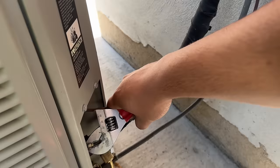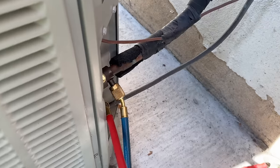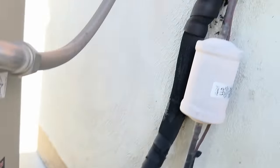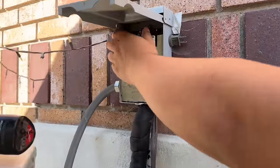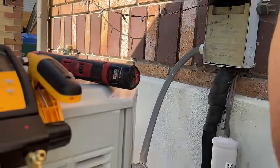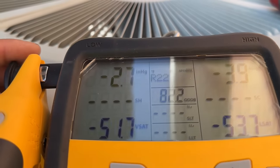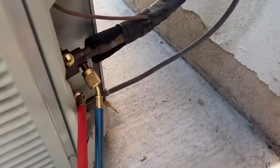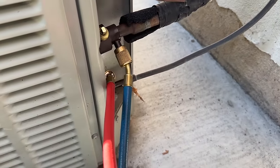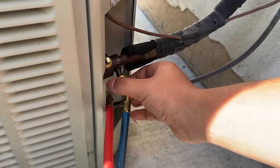Go ahead and close it — that's perfectly perpendicular. We're going to pull the disconnect out now. Hopefully, if it's properly closed, the pressure will not rise. Looks good — so we can disconnect our gauges, throw these caps back on, and we're good to cut the lines.